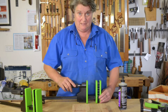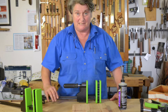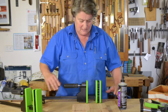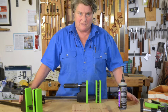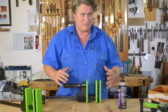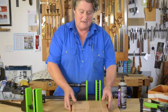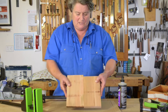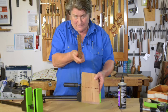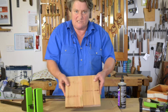Before we glue anything in the workshop, I suggest that the most important thing I teach all students is to have a practice run. As soon as you approach with a bottle of glue, the whole job will go pear shaped. So we have to practice. The first thing I'm going to do is literally set the clamps. I'm presuming that you've got two pieces of wood that are straight and square, so that when I put them together and put them in the clamps, I'm going to get a really sweet clean line.